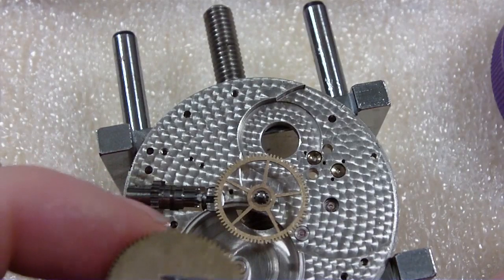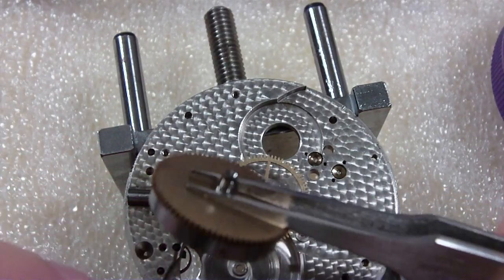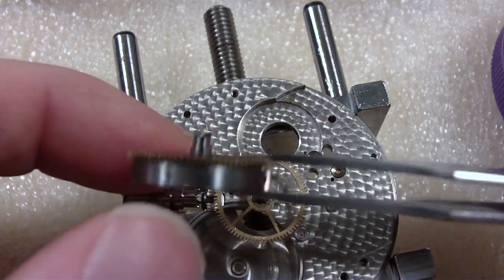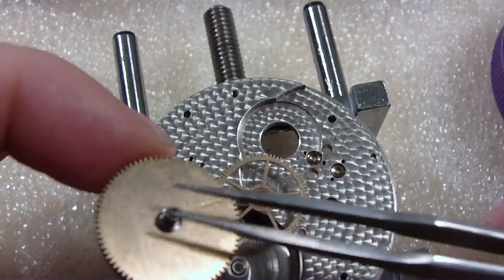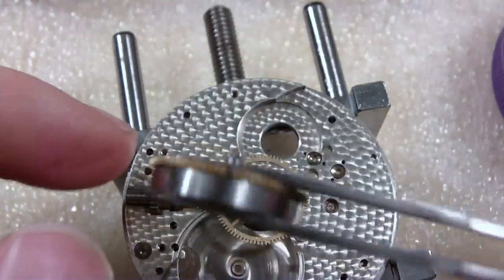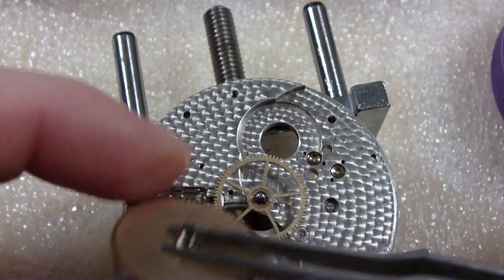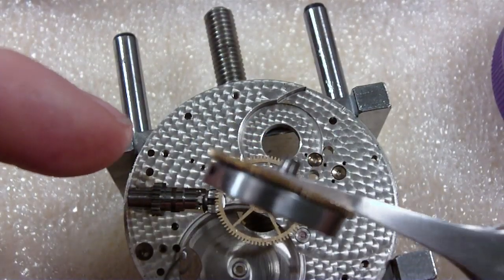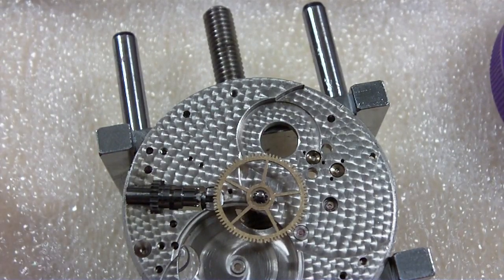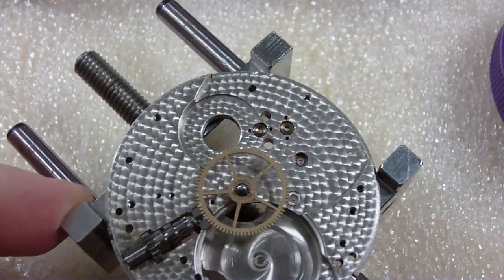It's something different because the barrel cover is not snapped on. I replaced the mainspring on one of these once — I have another 1892 — and it was really different. The barrel arbor is attached to the top cover, and there's no cover on the bottom. When you pull off this brass part the barrel arbor and mainspring come out too — it was a real pain to install a mainspring. Maybe I did something not quite right, I'm still learning. Let me dump that in there.